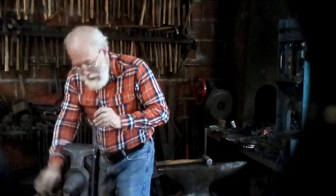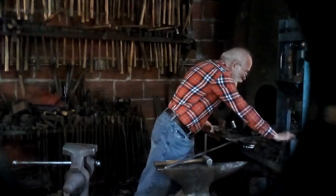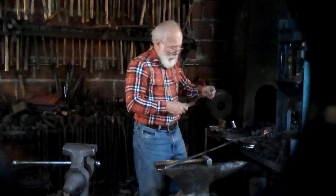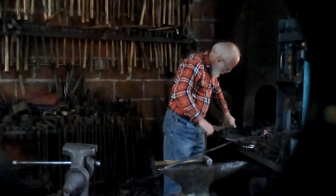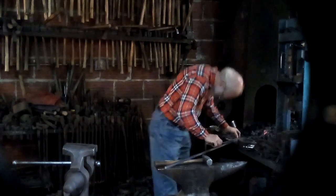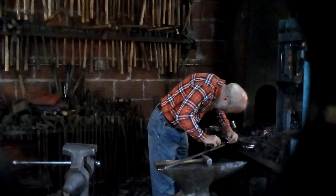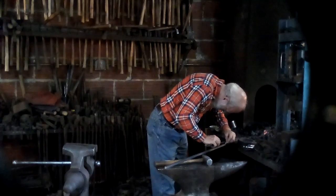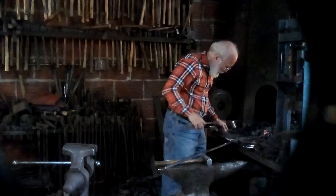All right, so I have a reasonably square rod on that end. And I know where I want to put this square. I want to put this square corner at 12 inches. So I'm going to mark where my 12 inch, that's where the heat needs to be. I want to center the heat there.